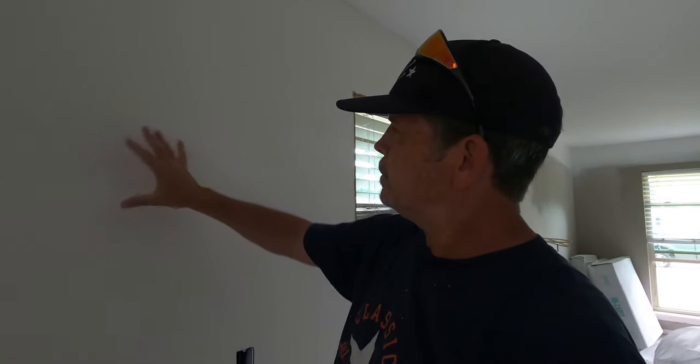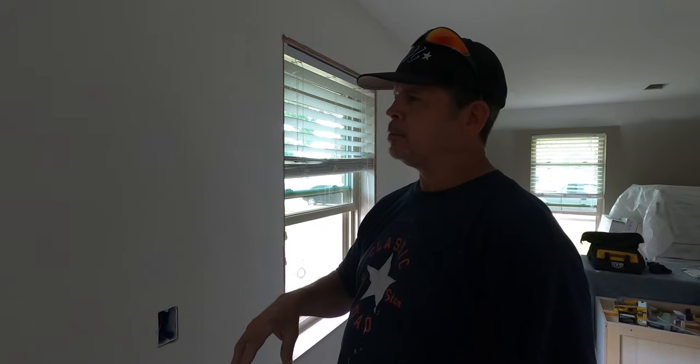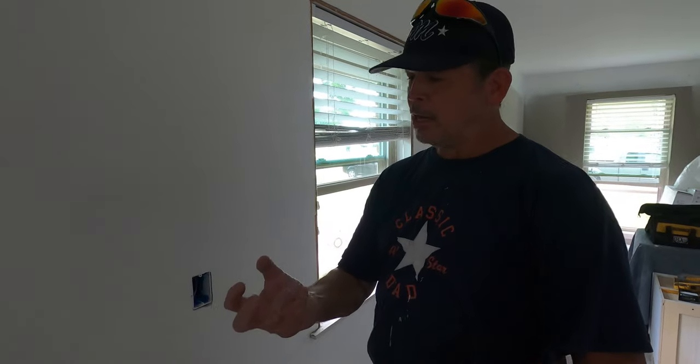Another thing on texture: sometimes when you're doing drywall work, matching the old texture can be the hardest part of the whole job. 30 or 40 years ago they were using brushes doing scallops and swirls and homemade stuff. I remember once trying to match a really rough texture — it was so rough we'd use it to scratch our backs. I bought all kinds of products that promised to match it, but none of them worked. So I crumbled up all the bags they came in and just dabbed it, and it was a perfect match. Sometimes you've got to do that.